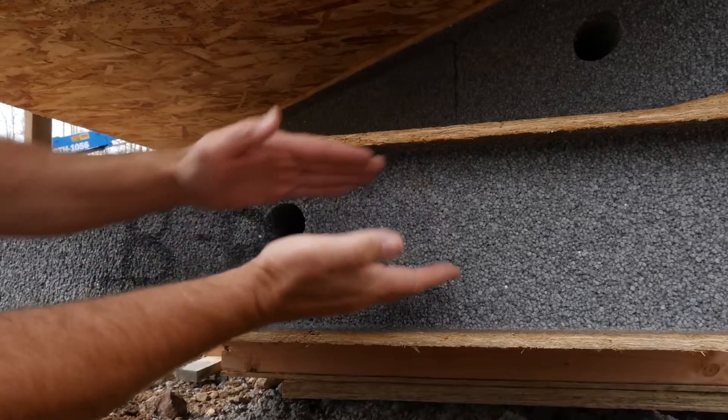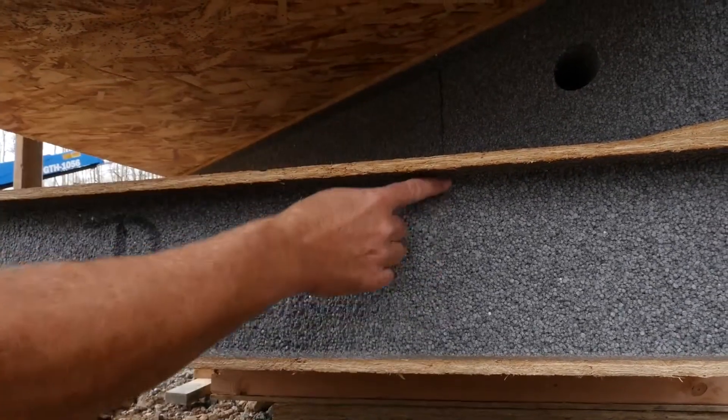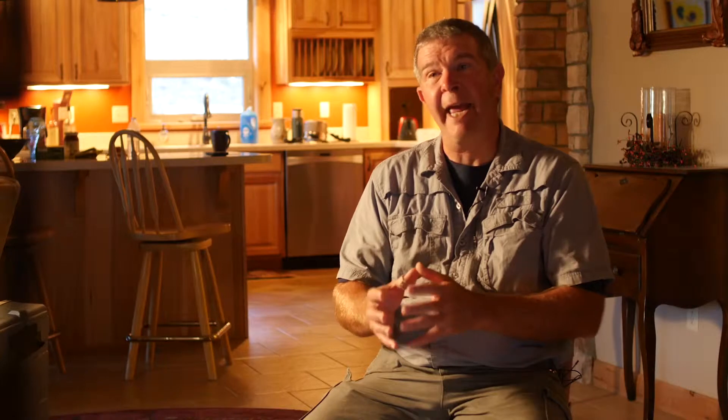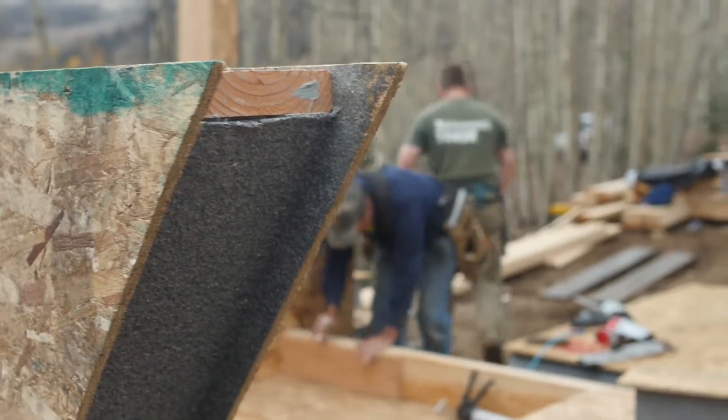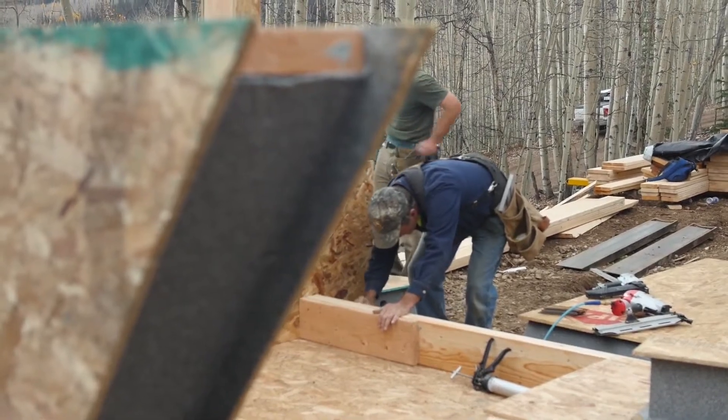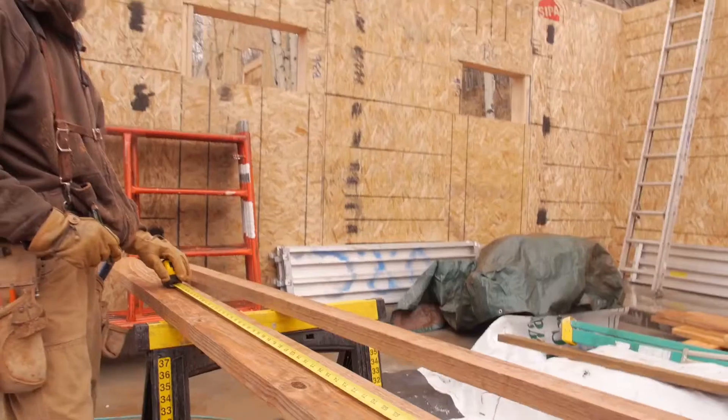The system has many options that allow us to put plumbing — whether vent stacks, waste drains, or lines — through a series of chases or specially constructed mechanical chase ways that allow a plumber to work seamlessly with a structural insulated panel system. One of the most often asked questions is how do we run electrical in a SIP? The industry has developed standard detailing where electrical chases are pre-cut in the foam core, and these chase ways allow the electrician to run wiring throughout the exterior envelope.